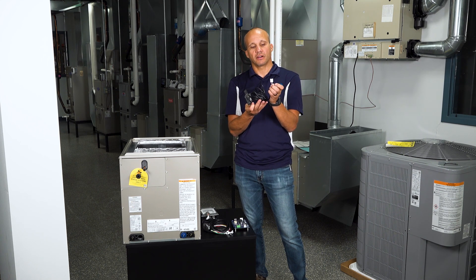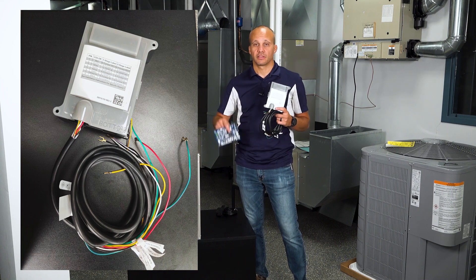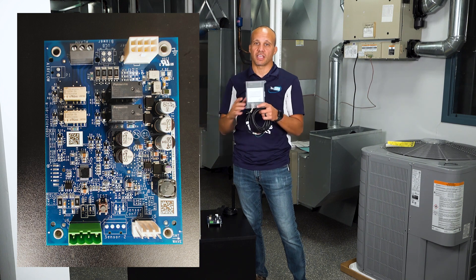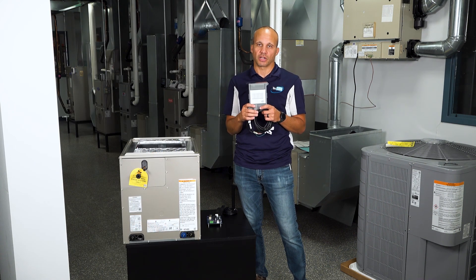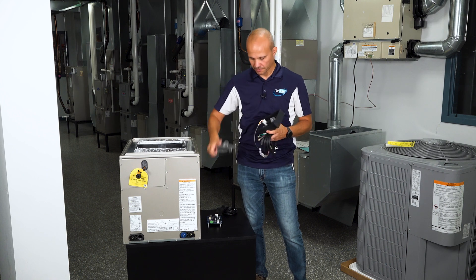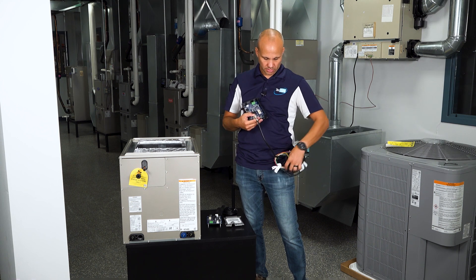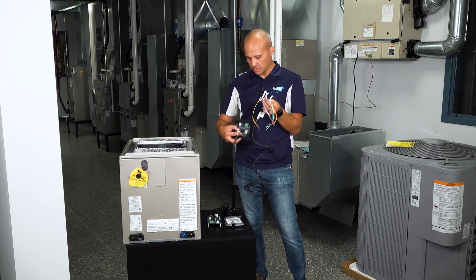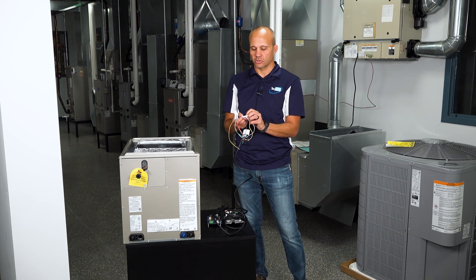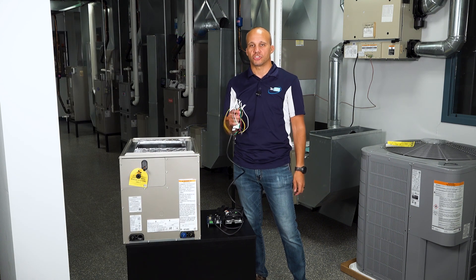There's a four-wire pin on the sensor that connects into the dissipation control board. That dissipation control board looks like this — if you have a fan coil or a rooftop you'll probably just have the board, but if you have a split system like today, it comes in a plastic enclosure so it can be mounted on the side of the return duct or on the wall. The enclosure opens up and we have all our wiring terminals inside. The eight-pin harness has all these labeled wires — a little intimidating but there's a wiring diagram that tells you what they're all for.